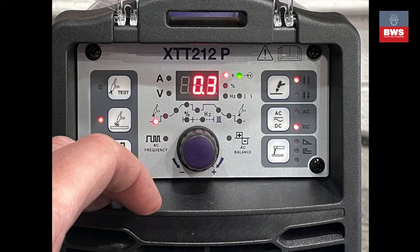Starting from the left of the graph we have pre-gas. This is a short amount of time required for the gas to reach the end of the torch. TIG welding is a high-grade weld, so we need to ensure we have correct gas flow before we arc up — if you don't, carbon from atmosphere can enter your pool and contaminate it, and under extreme circumstances this can damage your tungsten. The longer your TIG torch, the more time you will need. A good setting to start with is about 0.3 to 0.5 of a second. Turn the knob until the LED is on the torch symbol on the left, press and it will flash, then adjust to your desired setting and press again to save.